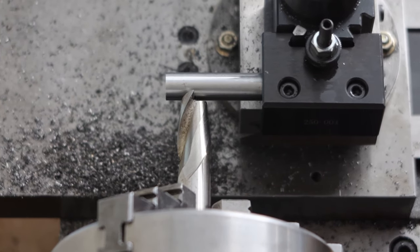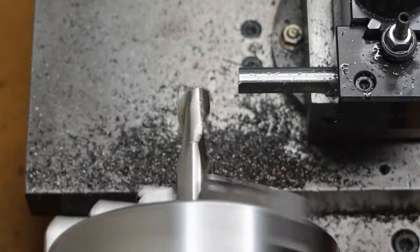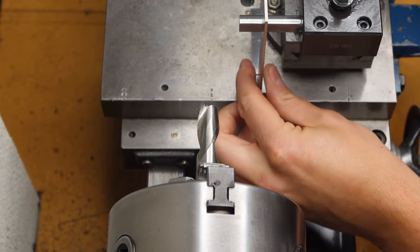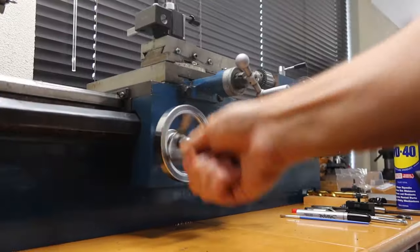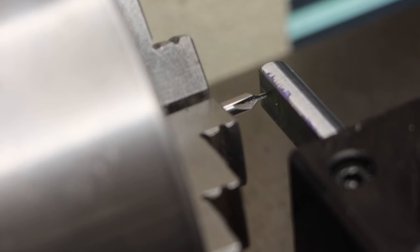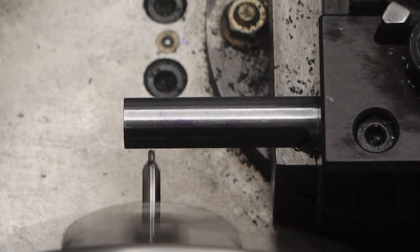Now that I've got the depth set, it's time for the moment of truth. I'm going to start with some very light cuts. I'm shooting for 9mm here, so let's see how we go. Perfect. Now I've got this face square to the lathe, I can use a cross slide and a set square to rotate the piece 90 degrees as best I can, and machine the back face parallel to the first. But before I do that, I'm going to try and get the piece on center as best I can, and then drill the two mounting holes. Last attempt with the Rycam... and yeah, it needs some tweaking. I know I'm playing with danger here using the center drill to score the face, but this end is already damaged. I was a little off with my center, so I'll make a couple of adjustments to the tool holder and then we're good to go.